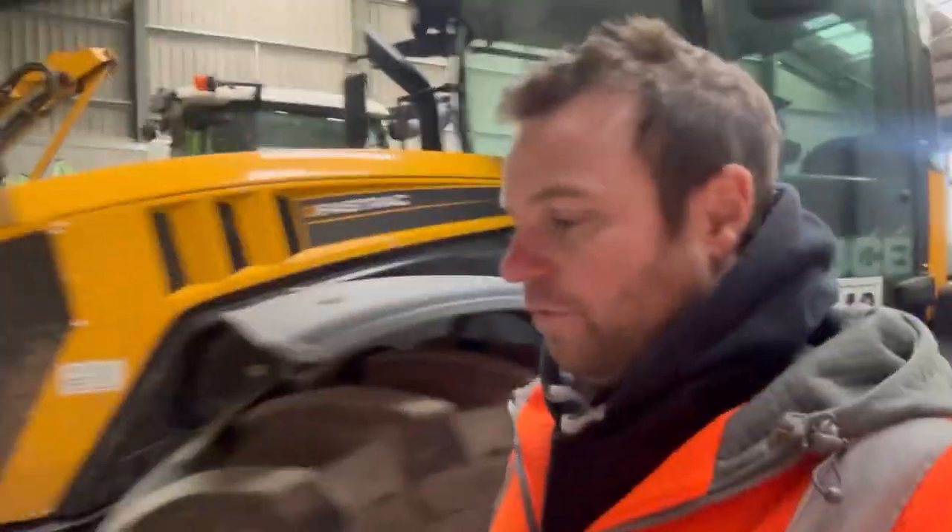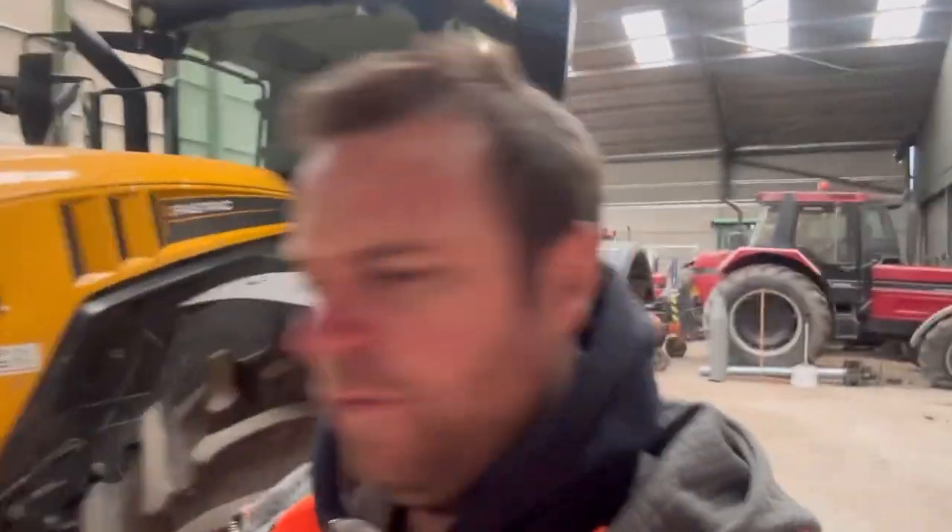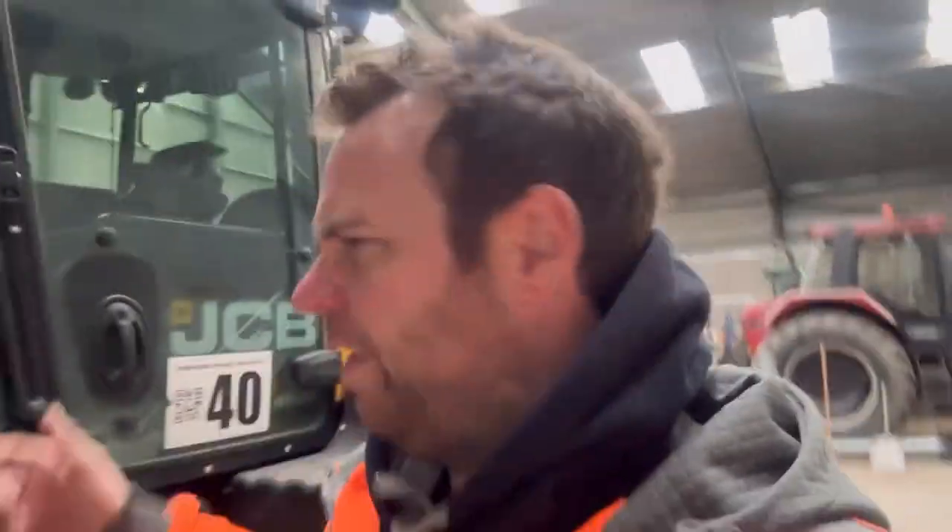It's Wednesday morning, just going to get the fast track and move the drainer nearer the workshop so we can change the auger on it. The auger that moves soil out of the trench has gone - Rob tried heating it up but it's not really been working. They said to cut a slit in the shaft, expand it a bit and pull it off. The cyclone mower on the front is about 700 kilos - should be enough to move the drainer a few hundred yards across the yard, saving us putting a weight block on another tractor.